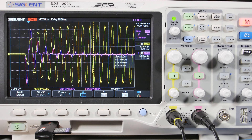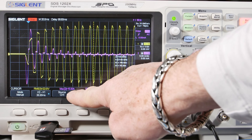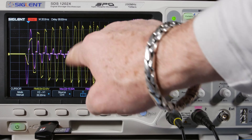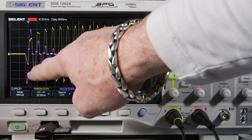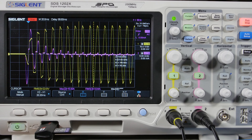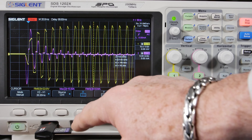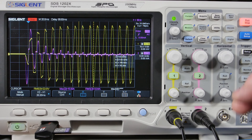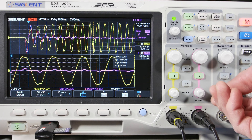Okay, turn off the switch and let the caps discharge. This reads 15 amps — five, ten, fifteen — looks like about 18, not quite 20 amps. We got a pretty good current surge down here. Let me zoom in on that to show you what's happening. There's deep memory — lots of cycles — and we can zoom in to see them.